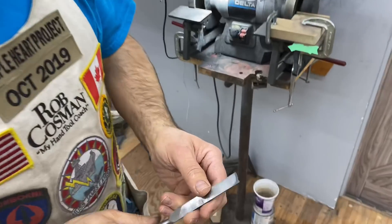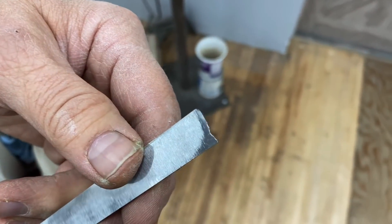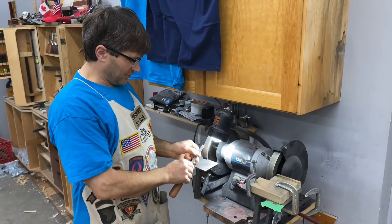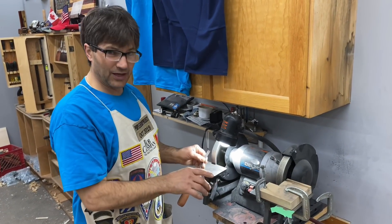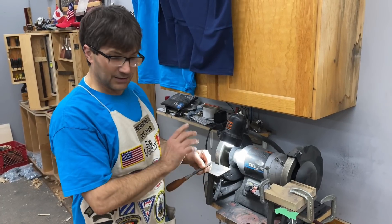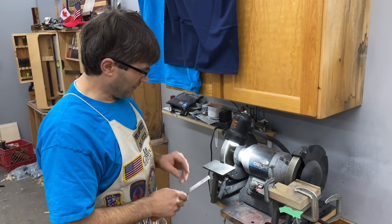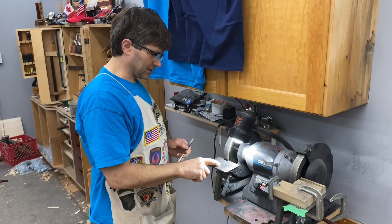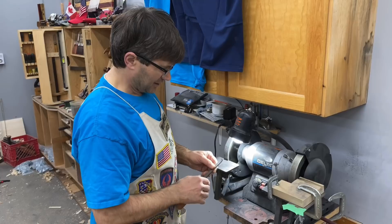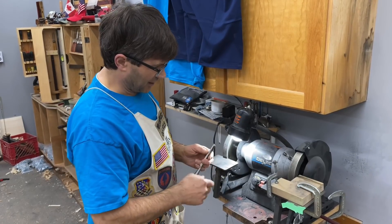Have a look at this — you can see all the chips out of it. You've got two options: you can grind it at the 25-degree bevel until you get down to the bottom. The problem with that is you're constantly dealing with just a wafer-thin piece of metal and it's going to be easily burnt. I find a far better way is to set your tool rest tangent to the wheel, come in, and simply square that off. Then once you've blunted it off, go back to grinding.